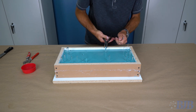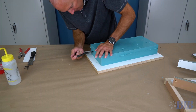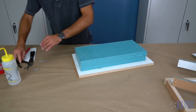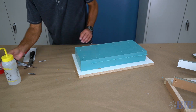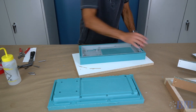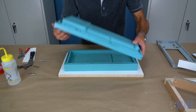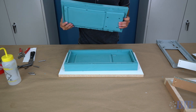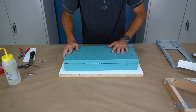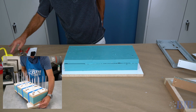I separate the molds and clean up any flashing. It's a good idea to wash the mold with a mild liquid dishwashing detergent like Dawn, then rinse and blow off with air. If you have a high-gloss finish you do not want to wipe the interior of the mold, as this can scuff up your mold surface and adversely affect your part finish. For parts of this size or larger, I make a base plate and top plate to keep the two halves from separating. This will give you more accurate parts and less flashing to clean up.